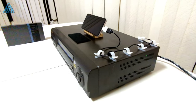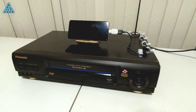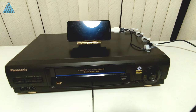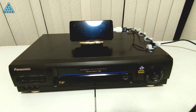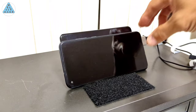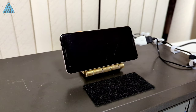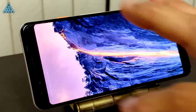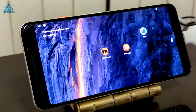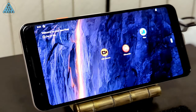I've reassembled the VCR and mounted the display to the top of the case. Cable clamps are glued on to help keep the cables organized. The display is glued to a flip-up stand so it can lay flat when not in use and sit raised up for easier viewing when converting videos. I had to make a change to the display from a Galaxy A11 to a Pixel 3. In testing I had a problem with no audio being recorded and found Android devices require Android version 10 or later. I did have version 10 but there must have been some minor detail that prevented it from recording audio, so I switched to my spare Pixel 3 which uses version 12 and that fixed the problem.